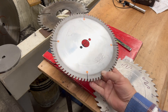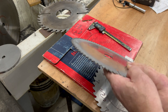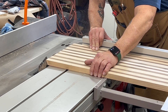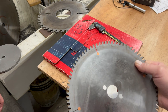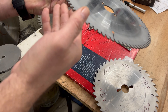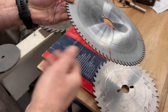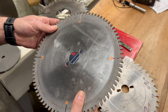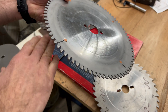This blade is an FS Tool blade — I believe it's an 80-tooth — and I was using it on my table saw doing a 45-degree miter on a piece of birch and got burning on the wood. One side is clean but the other has pitch buildup. Scott explains that was excessive rubbing: the workpiece was binding underneath against the saw, while the cut-away side wasn't touching, so no buildup there. It wasn't a settings issue — cutting on a 45 like that is pretty extreme and there will be pressure from the table and the saw.